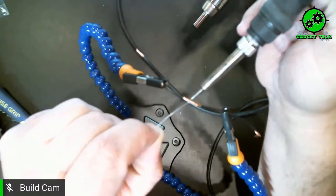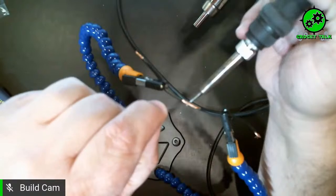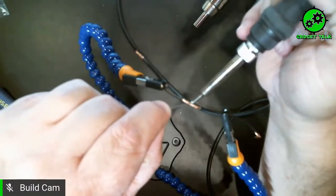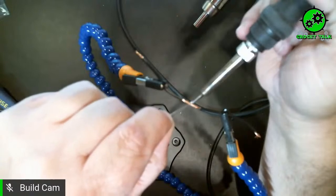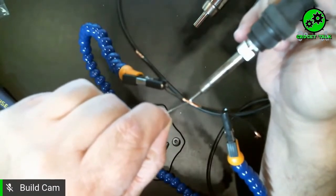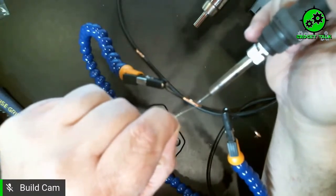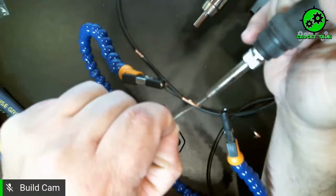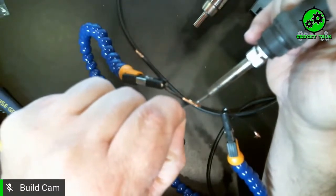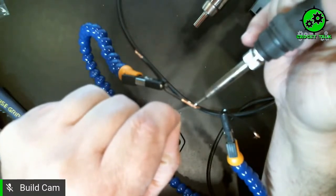So the technique that you're using is that you're putting the soldering iron actually underneath the wire and putting the solder on top of the wire. Yeah. Right, because you want to heat the wire up and then solder will melt to the wire. I bet my tip is just way too small. I don't think I ever tinned this size wire, not with this gun. I really mainly go to PCB boards, which is what this tip is.